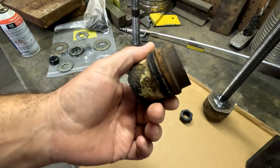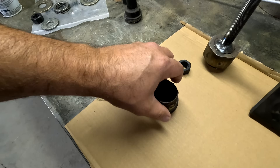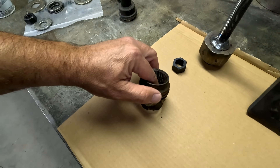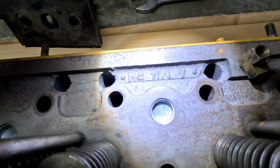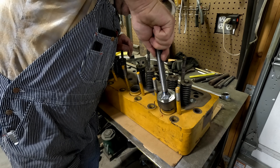The head we're going to be working on today is from a very early RD4 — I think it's serial number 4G0336 somewhere around there. Here's the pre-combustion chamber that came out of number 4 on our 4G, and I suspect that's going to be an issue on theirs too. I can sort of see inside where it's kind of rust-colored in a few places where it's starting to eat through. They suspect number 1 has issues because of discoloration on the injector, but I've found that to be consistent with healthy injectors on others I've taken apart. So my theory is if we find something, it's going to be number 4. The head is dated AMNRN — May 20th, 1940 — so it's probably not the original head, probably a 7J series. We're going to start on number 4 because these tend to be the culprits on the D4400s.